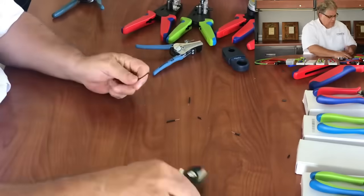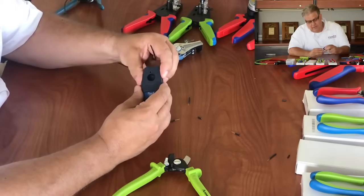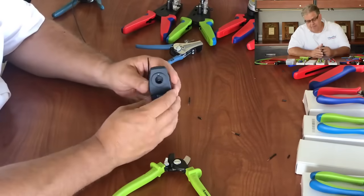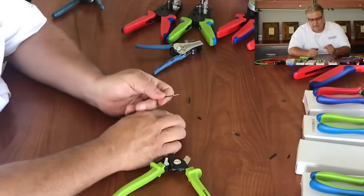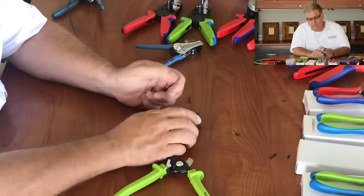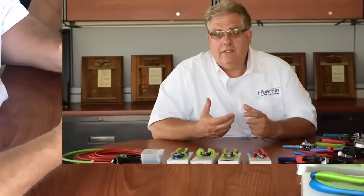The other type we sell is what we call a rotary stripper. It has a dial you can turn to set different settings — what you're setting is the height of the blade off a stop. There's a blade inside, and what you do is spin this around — or you can spin your fiber — and it actually cuts into the jacket. It makes a nice clean cut, and the depth setting controls how far it stays away from the core. With stripping there are all kinds of different plastic fiber optics, so if you can't find exactly what you're looking for on the website, just give us a call and we'll try to match your fiber with the best stripping option.